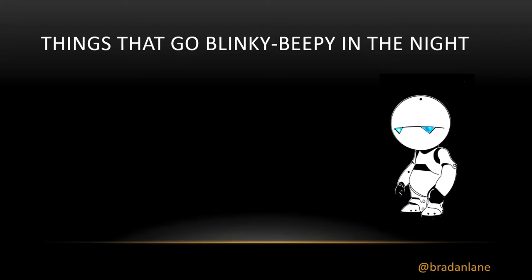A much easier place to start is something like a simple add-on. These are typically just a creative-looking printed circuit board — we have Marvin here — and a couple of LEDs. The SAO connector has a standard pin-out, and that's really easy to follow. So it's a very easy entry-level project. They're also a lot of fun. If you already do electronics, create an SAO. They're great to give out or even make a little bit of money with.